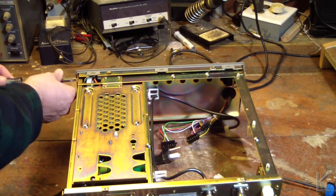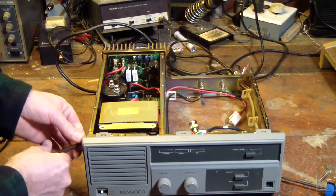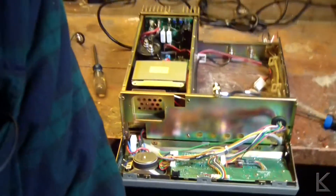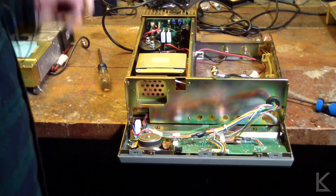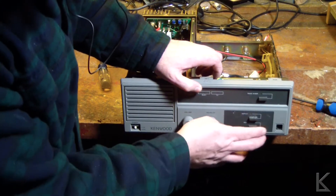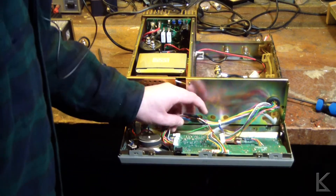I see what they did on the front panel — this is nice. Loosen those screws and it's a hinged assembly. The front panel just hinges forward for servicing. And then we've got a nice little 8-ohm speaker and two boards: one board has the switches and the microphone input jack, and the other has the controls and the digital electronics that control the repeater.